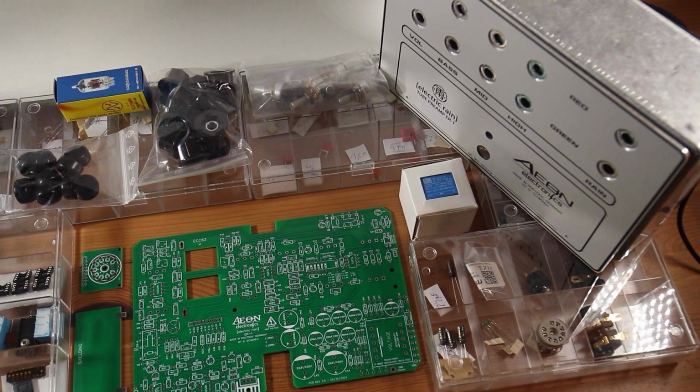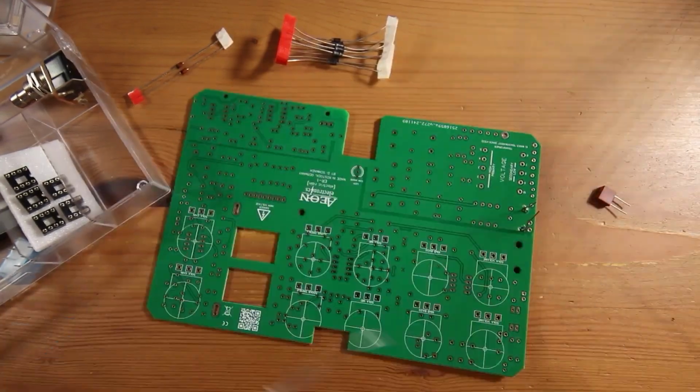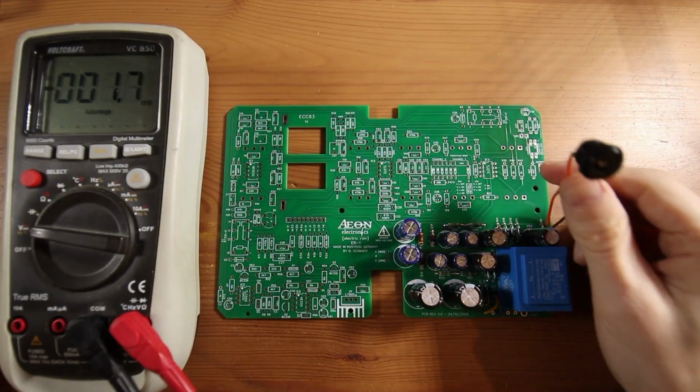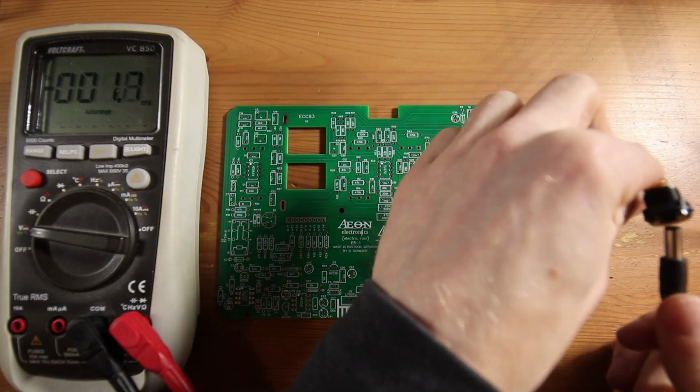And these are all the components for the preamp. I've already picked them out. But first I'm going to solder the power supply part of the circuit. Normally I would recommend to start soldering with the lowest or tiniest parts, like resistors or diodes. But when it comes to testing new builds, it is better to solder each section after another. This way you can test them separately, and in case something goes wrong, you can way better nail down the fault to a specific part or component. To this moment in time, while shooting this video, little I know that I will encounter exactly this.